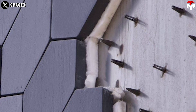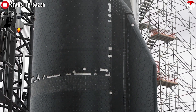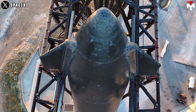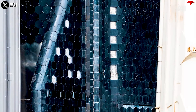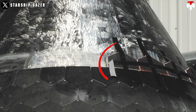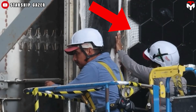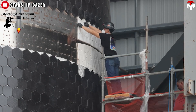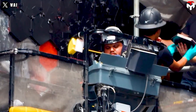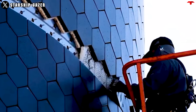In addition to the glue, SpaceX also uses metal pins. Normally, the heat tiles attached via metal pins have the standard size and are thinner. The thick ones from the leading wing edges and nose cone are attached with glue. Both serve different functions, with some being thinner for weight reduction and others thicker for added insulation. Beneath the thinner tiles, there is a white ceramic mat that provides additional insulation and helps minimize heat transfer to the hull. For the area using glue, you cannot find any white ceramic mats in there because they need a direct bond to the ship's body to stay in place.